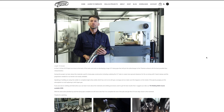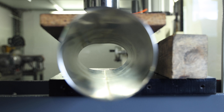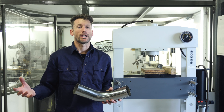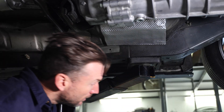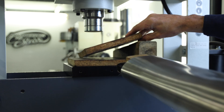Ovalizing the tube yourself can be a great way to maximize the flow whilst maintaining ground clearance of the car. I'm using my hydraulic press to ovalize this tube and what works really great is using timber on the top and the bottom — this softens the bending process and gives the tube a nice transition from round to oval. The amount that you ovalize really depends on your application, but be careful if you go too far as it'll try to kink the corners. Then using a v-band collar on the opposite side to maintain the roundness on the other end.